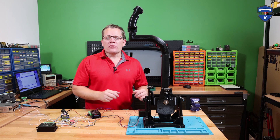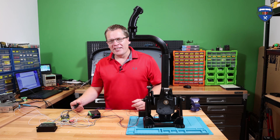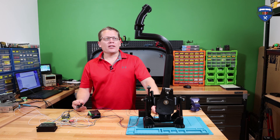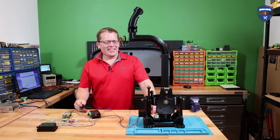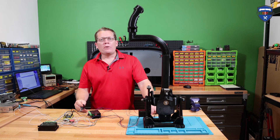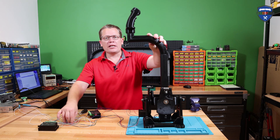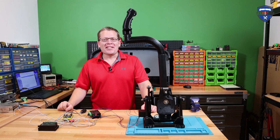Because we're using stepper motors as mag brakes, the ingenious thing is they can also act as parallel actuators. I've got the beep trim here — Mobile Flight is running to my right — and if I push forward you can see we can now control the cyclic position with beep trim. It's at zero, and it's the same for left and right. Even though we've beep-trimmed, we can still move the controls anywhere we want with that force trim feel, then quickly press force trim to move to any position, re-engage it, and continue trimming as required.